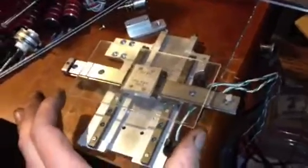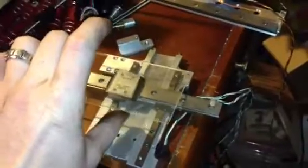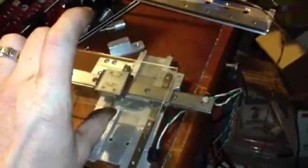And you'll have a little, I don't know exactly how big this is. I think it's about, say, 5.5 inches by 3 inches build area, and then I'm going to make it at least 100 millimeters or 150 millimeters Z height, because why not? If I've already got this small of a build area, I might as well make it tall. So it might even be 5 or 6 inches tall, because you'll be able to take the 45-degree gantry that holds the up-down slider for the extruder. You'll be able to take that off and lay it down in the case for portability. So this is going to be pretty cool.